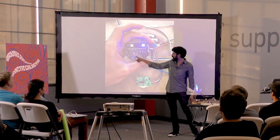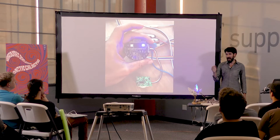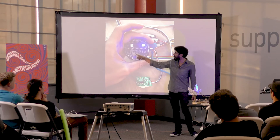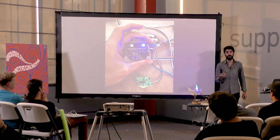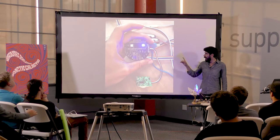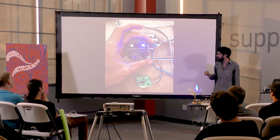The way the breath sensor works: it's called a hot wire anemometer. An anemometer is a wind sensor. You apply a voltage to one side of two resistors and measure on an ADC what voltage you get back out. As you breathe on them and change their temperature, you get slight voltage differences — they're thermoresistors. Inexpensive, and you can get extremely accurate breath sensing just off those two little resistors and a few passive components. We also lifted this design from Modern Device — so I'm sending my next paycheck to them.